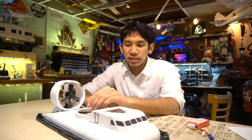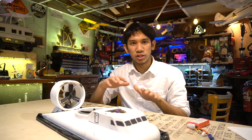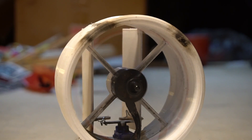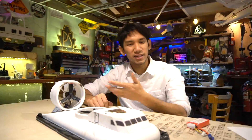Driving the hovercraft is pretty easy. It's really kind of like driving a jet ski, where if you try to coast with the throttle off you really can't turn. You need to be jabbing the power right as you add in a rudder command to get the thing to kind of slip around. It's like driving a jet ski on water or driving a car on ice. But as soon as you let off the throttle, the car comes to a complete stop — unlike ice, where you just slide and probably crash.